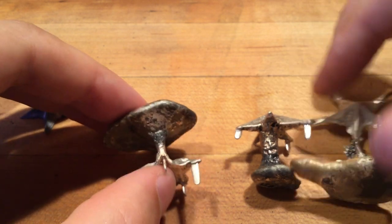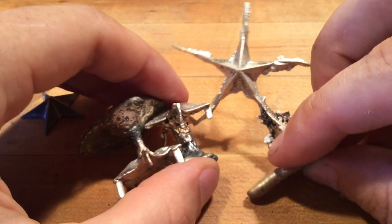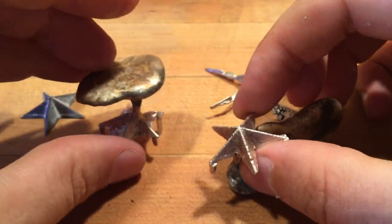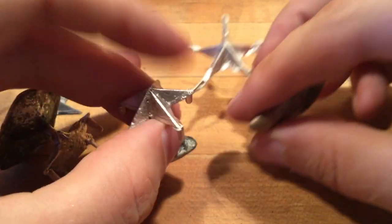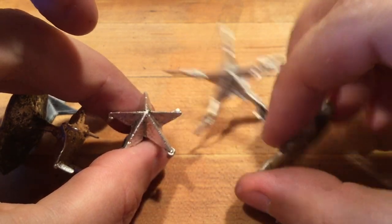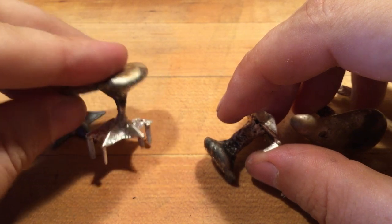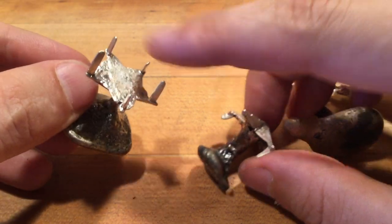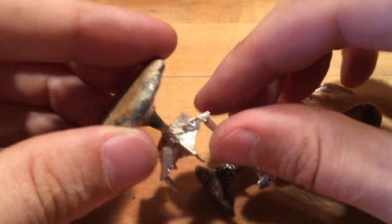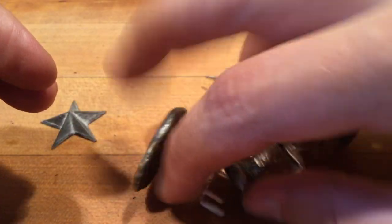for the sand cast parts. So we have sprue to the point, sprue to the back, and sprue to the face. Sprue to the point and back turned out beautifully, and these are the edges we want to preserve. And sprue to the face, a lot of cleanup, the casting was done well, as seen by the vents, but the final product is not something worth keeping.